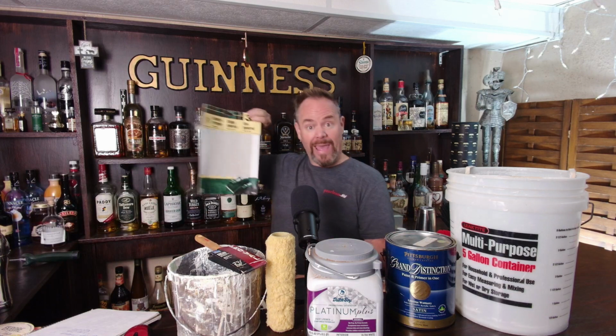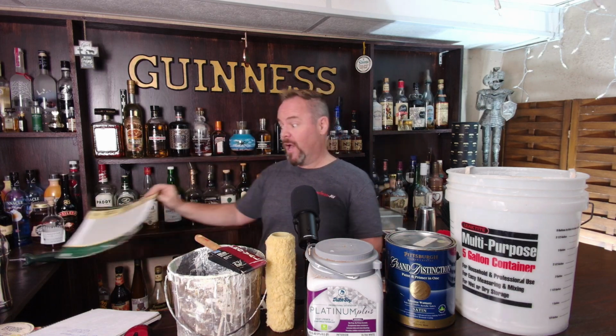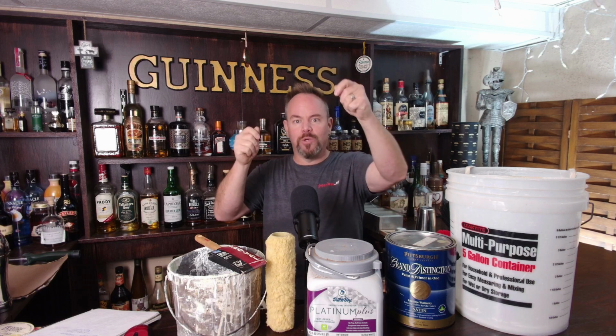And you can buy a package, the general use package, that has a number of different grits built into the packaging. So as you take them out, you have one or two 120s, one or two 180s, and then one or two 240s. And then you have everything that you need to sand your walls. Now you can use a sanding sponge as well. I don't have one of those, but just so you know, those sanding sponges work very well. Just watch your grit number. Again, the lower the number, the rougher the grit. The higher the number, the finer the grit. When you sand with a higher grit, you're going to get a finer, smoother finish.